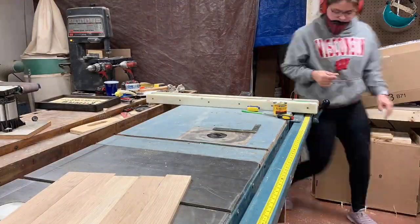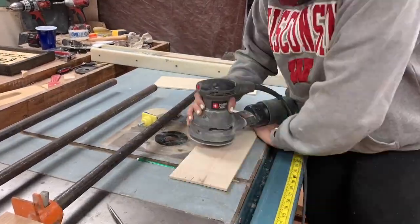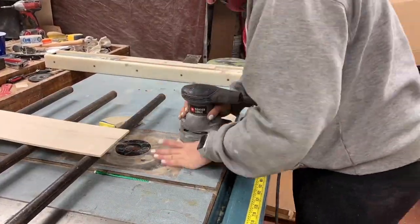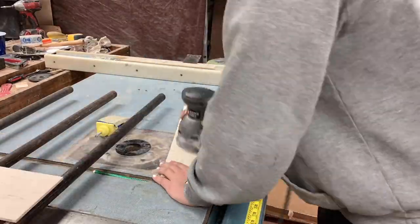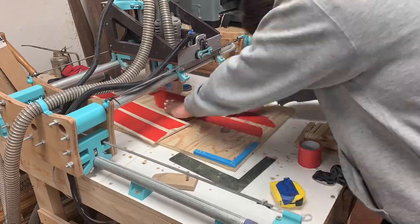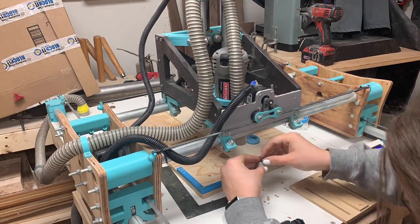I ended up with two different size boards instead of the large one. I usually don't glue up signs this big with this many pallet pieces — I usually just find a bigger piece of wood, two bigger pieces to glue together. I just did a little extra work on some corners and then went through and glued it together. This is the same process for basically every board I want to make bigger or wider. I just glue two wider boards together. This is an example of what I do for my letters that I'm going to cut out — I plane the wood down to the right thickness, sand it starting at 40 grit, then 80, then 220. I just use my super glue and tape method on my CNC with a thin straight bit and cut out the letters.